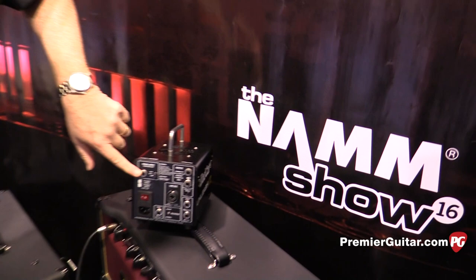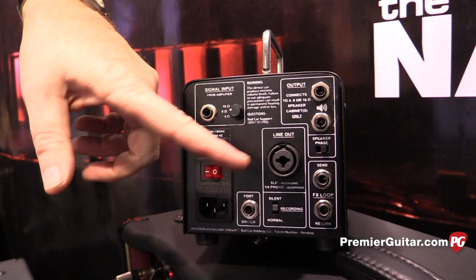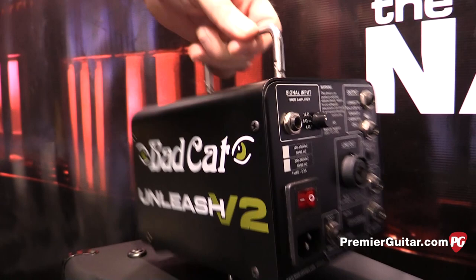Essentially you could probably drop this thing in a swimming pool, dry it off, and play it. It's got switchable input impedance, which it didn't have before. It has a line-out to go to a mixing board, a cab-simulated headphone jack, a silent record feature, the same effects loop, and the speaker output is now a quarter-inch — it used to be Speakon connectors. Foot-switchable. You can take any amp — 5 watt or 100 watt — into our reactive load circuit and make it go from whisper quiet to screaming loud, with an effects loop and two switchable volume levels for rhythm and lead.